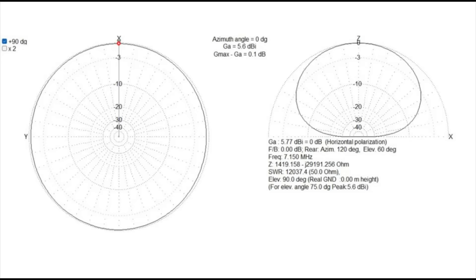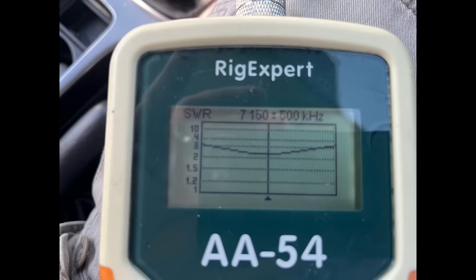As you can see, plenty of contacts on 40 metres. I was pretty loud throughout the UK. I worked 38 stations — I was on 40 metres for about an hour, so a nice steady trickle of contacts and really enjoyed myself. A couple of people said it was the loudest they'd ever heard me on 40 metres, which was really gratifying. And all done with just about 33 feet — that's 10 metres of horizontal space, which is another really big bonus. By the way, you saw the SWR there: about 2.5 to 1, 2.3 to 2.5 to 1. Now one or two of you might recoil in horror at the thought of an SWR which isn't quite where you want it to be.